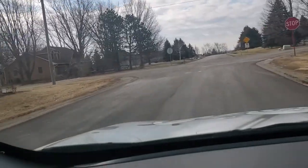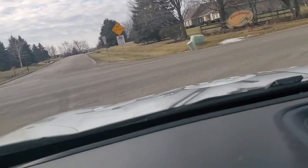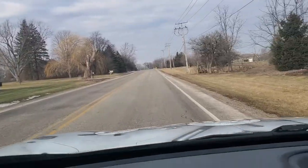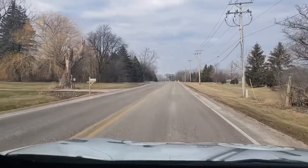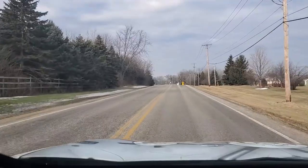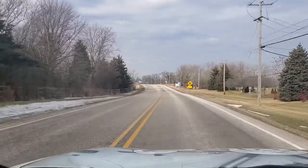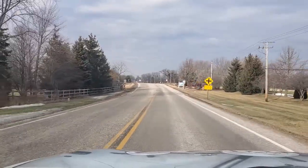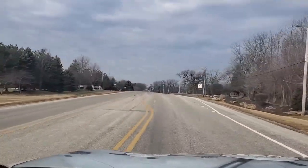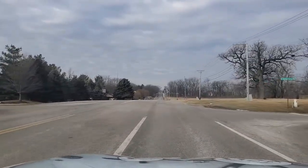Alright guys, Jeff with HKS Systems Lock and Safe. We got done with that safe - we were there last week and it wouldn't close at all. I had him remove all the guns; I'm totally comfortable with firearms but they're not my firearms so I didn't want to leave them laying around. The whole skin on the back of the door was full of handguns and ammo so he needed to remove all that. Then all I did was come back and adjust those hinges up just a little bit - maybe a 16th of an inch, not even that, super fine adjustment.